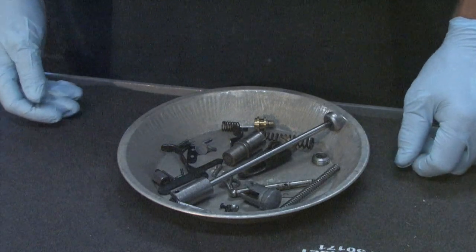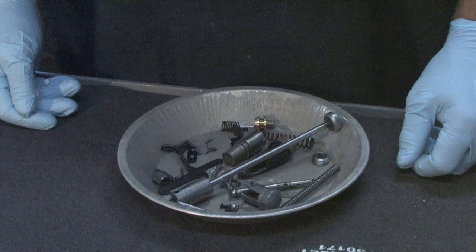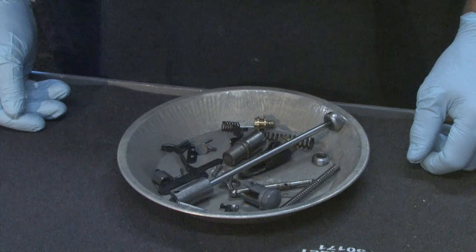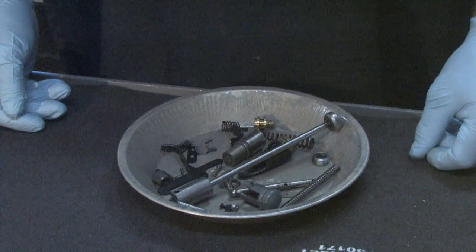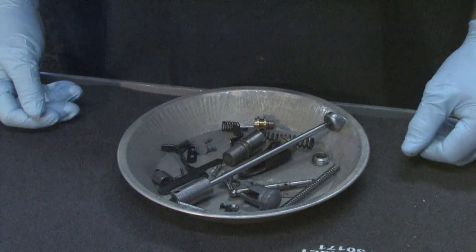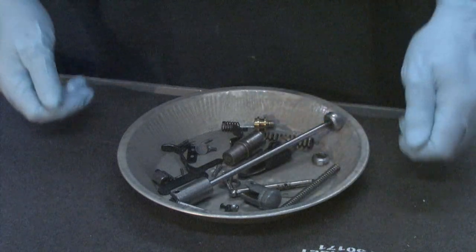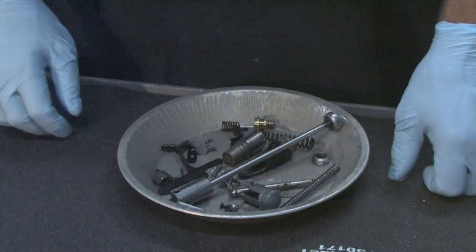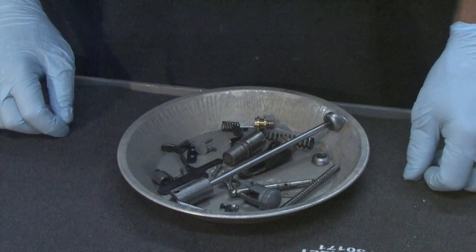The other rule is that harsher chemicals clean better, and it's just a fact. Chet Paul's down in Fresno, California. He's an airgun repair smith, and he went back to Crossman, I think for one of their last classes years ago, on how to do airgun repair on Crossman guns. And he said it seemed like they were using carburetor cleaner to clean parts. And carburetor cleaner will clean them, brake cleaner will clean them. But it's a harsh chemical. It'll also take the skin off your hands and turn your clothes different colors. And so I tend to not use the harsher chemicals if I don't have to.